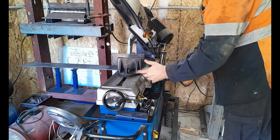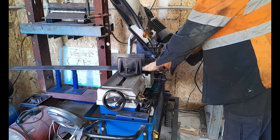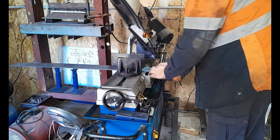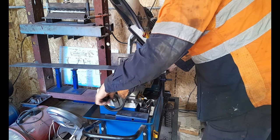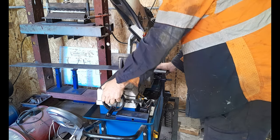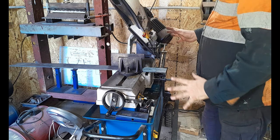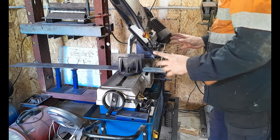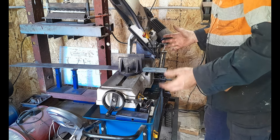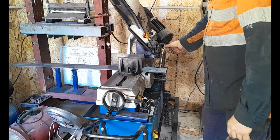It comes with a lubrication system, a pump, etc. I make my own cutting fluid with detergent and canola oil, believe it or not. I've got linseed oil in at the moment, a mix of linseed oil, detergent and water. Very cheap to keep your reservoir filled. And look, these are so quiet, really quiet, and no sparks. So I can do this even getting late in the night and not disturb my neighbors when I've got all my doors closed.